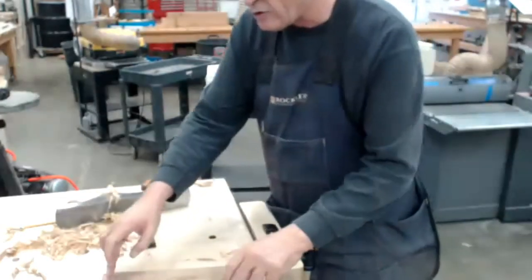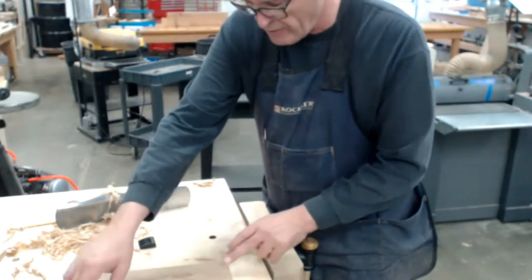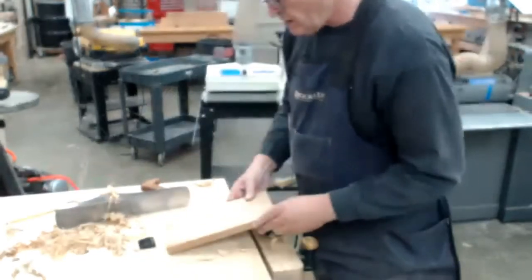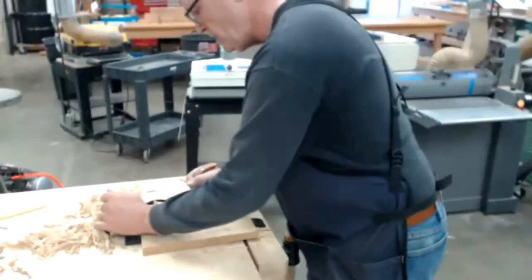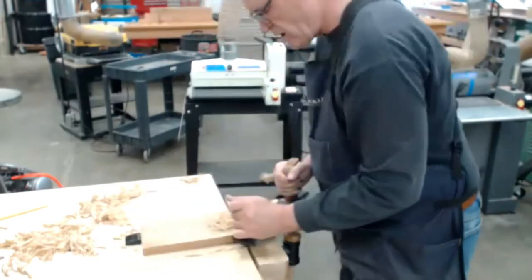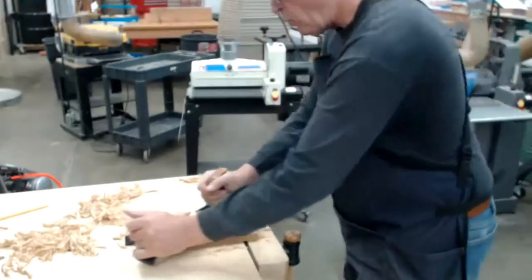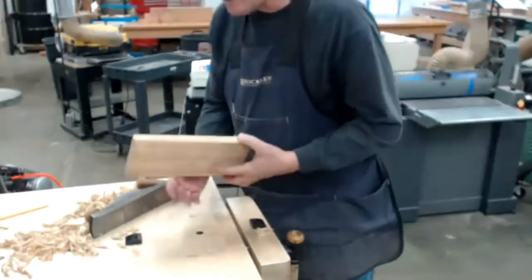I am still high on these corners, so I'm going to go back and mark these corners where I need to take them down. I'm not going to go all the way across the board — I'm going to start working on these corners to try to get it more square to lay flatter.